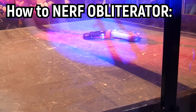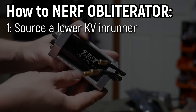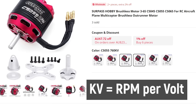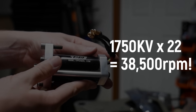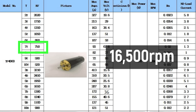And I have three ideas on how I'm going to achieve it. Approach number one: simply swap out the inrunner for a lower KV variant. The KV value for a motor gives you the motor's theoretical RPM value per volt, which means that the current 1,750 KV motor spins at 38,500 RPM at 22 volts. But a 750 KV motor would only spin at 16,500 RPM for the same given voltage.